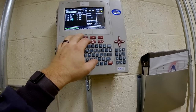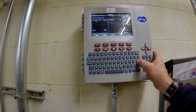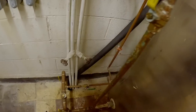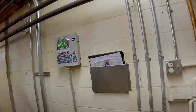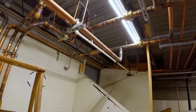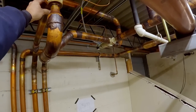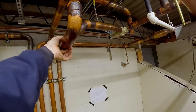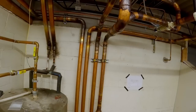We're still in split there. I thought it was under sensors — heat reclaim hot water control. There's the sensor right there at 59 degrees, then the one coming in is ice cold down here. Hot is going into the top and we're mediocre coming out. As far as this other one, we are coming out of the bottom now, not going through it anymore. It's getting the heat stolen by the heat reclaim — if I turn the heat reclaim off, it should crank it over.